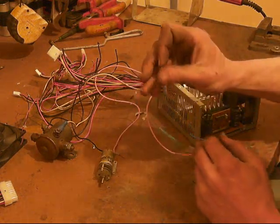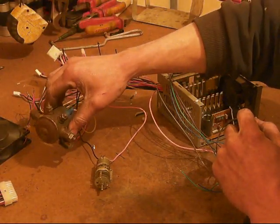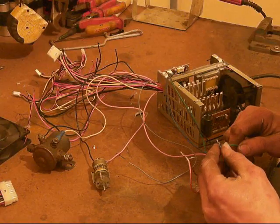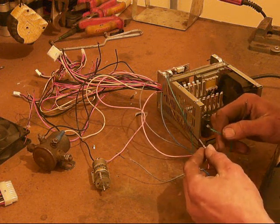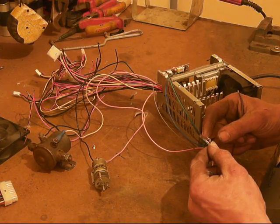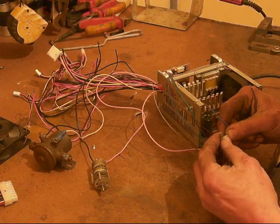If I connect the proper wire to the brown and orange, the 3 volt side works perfect, the 5 volt side works perfect, but the 12 volt side is not working at all. I've tried so many combinations of these wires. I've had it so it's clicking really fast. One combination - I think it was the grey with the brown - the 12 volt works but then it goes on and off straight away. Another combination is green, orange, brown and grey, and if I touch the blue onto them it switches everything off.